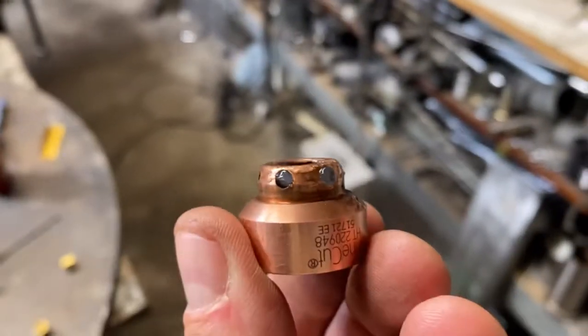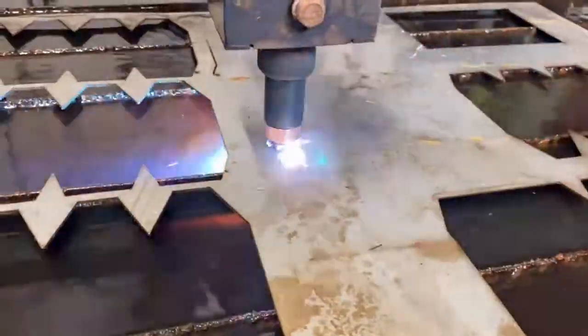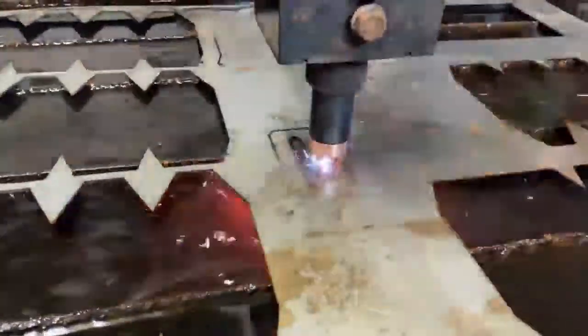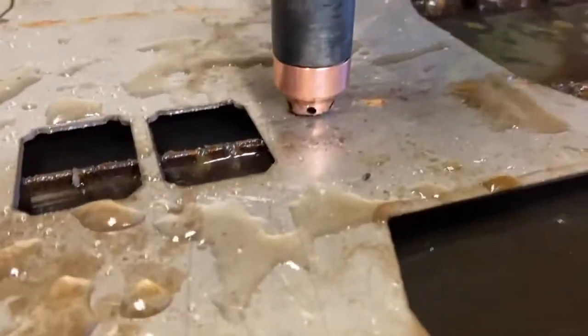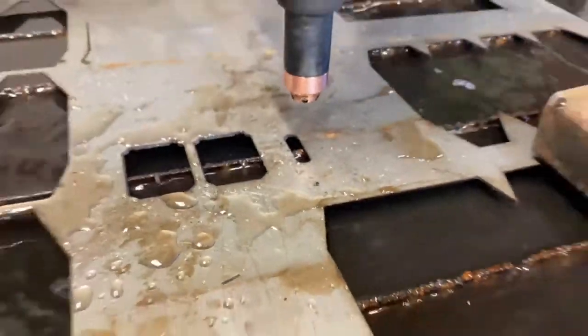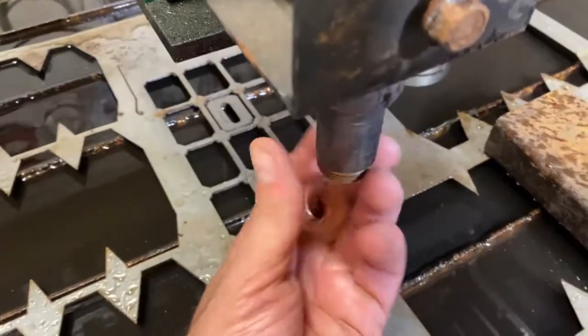What's going on fellas? Today I got a ninja trick for all you manufacturers and DIYers out there. What we are doing today is putting nozzle gel for MIG welders on my plasma table. This is a Premier plasma table and I do a lot of stainless steel cutting, and my tips are getting clogged up with dross left and right. It ruins the cut and it ruins the plasma tip.